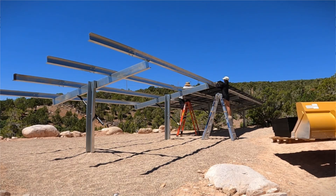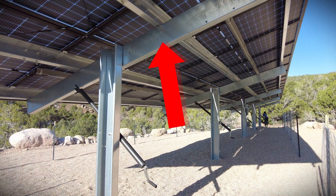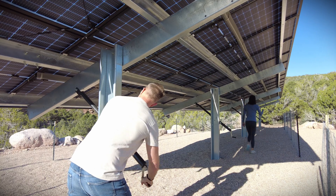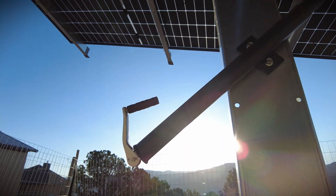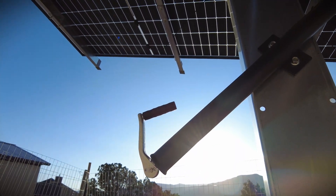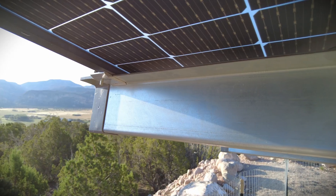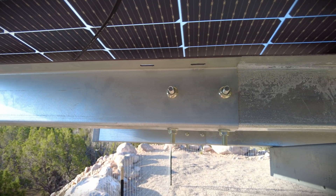Across those we've laid five 71-pound trusses, each pinned with a single large bolt so the rack can pivot for seasonal adjustments on that single bolt. Then we've added five manual jacks so that we can make the adjustments throughout the year, and 16 z-purlins spanning the trusses and cantilever extensions on the east side so we can squeeze in two extra panels for a total of 44.